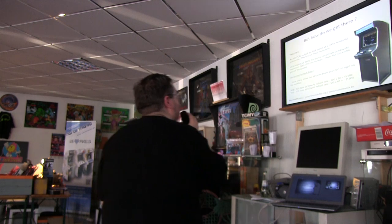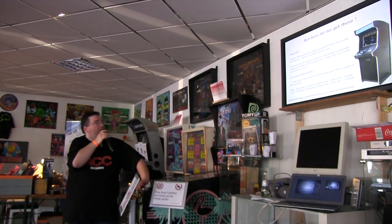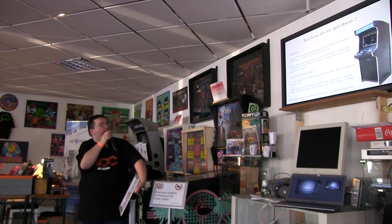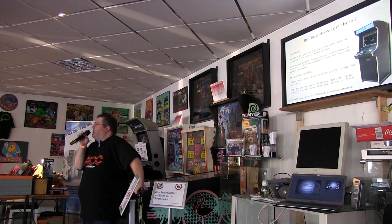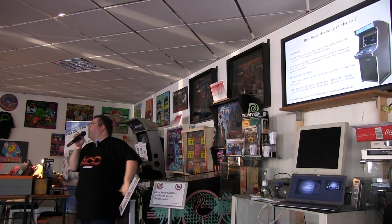So as I said, the 15 and the 31 kilohertz, why is it important and where do we get those numbers? If you look at a normal 15 kilohertz RGB arcade board, you have more or less 300 lines at 50 half frames or 50 frames a second. This gives you 15,000 times a second that your electron beam goes left and right in your monitor. It will go up and down 50 times, but it will go left and right 15,000 times a second. That's your 15 kilohertz signal.